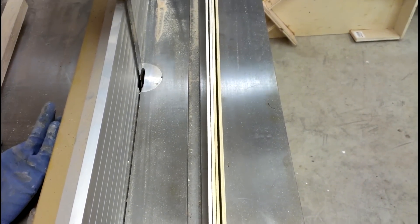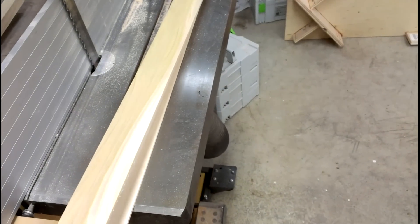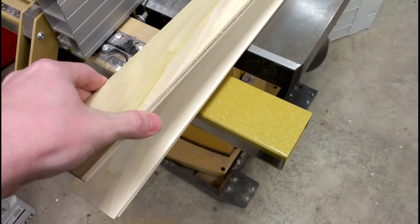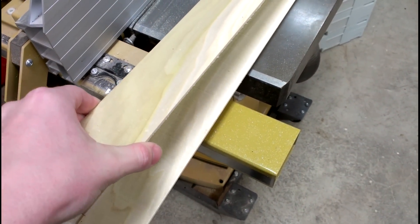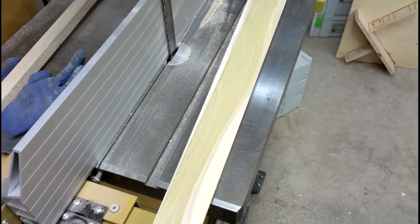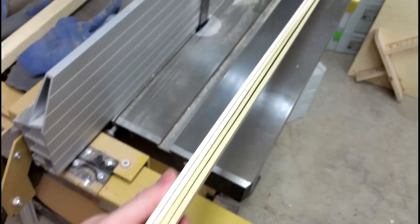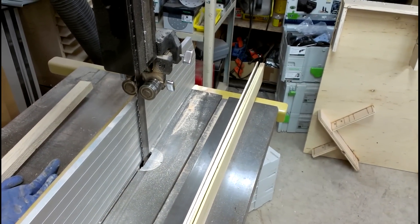When you're doing this, just make sure you keep all of your plies stacked in the order they were cut, with each corresponding cut facing one another. That way if there's any variation in the blade, it will be mirrored on the opposite cut.